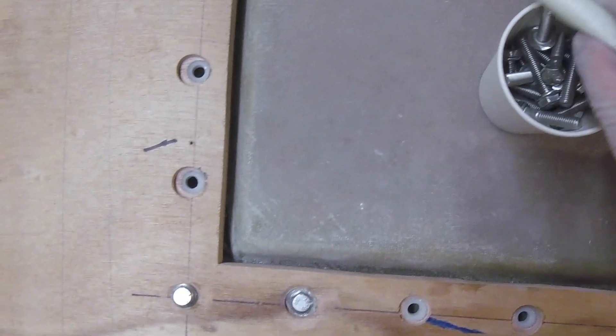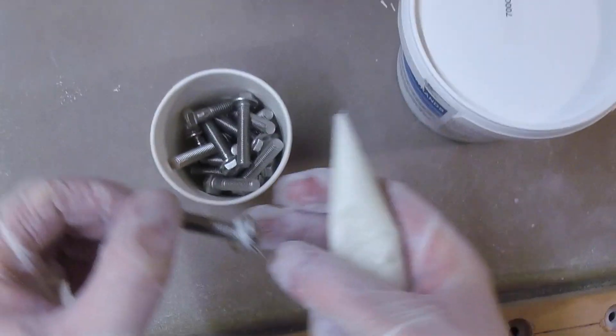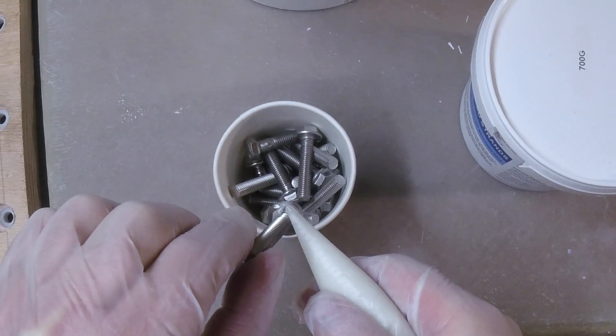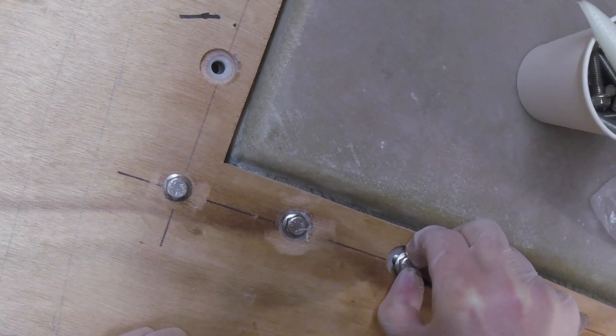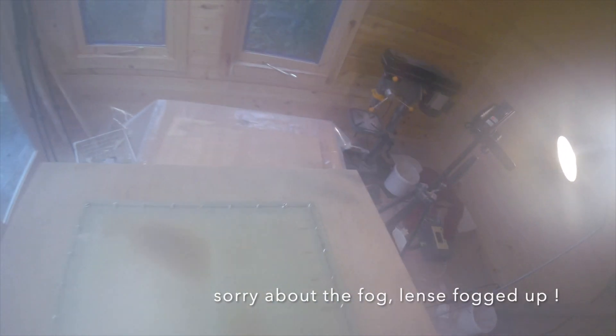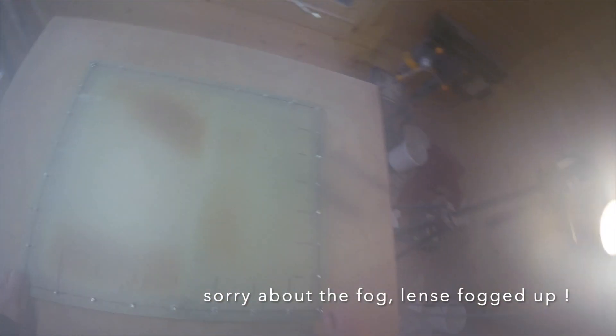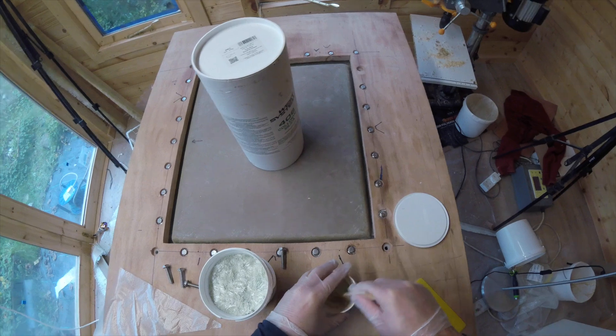This one is probably too much epoxy. Not quite so much, I think — just in case it's not right I need to be able to knock it out, because this stuff is super strong. Right, let's have a look. They're tight. Now I can tack in my four corner pieces, really fill these up and have them bedded down nicely — lots of chopped strands.